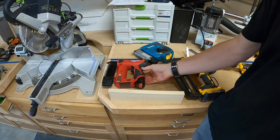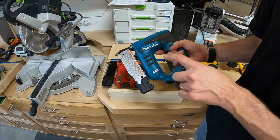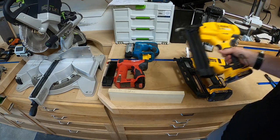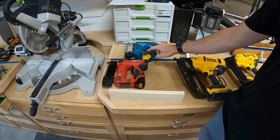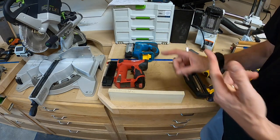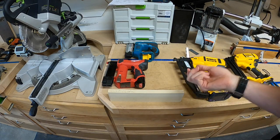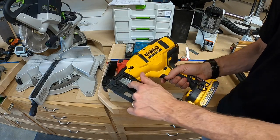The battery pinner is only 12 volt and weighs next to nothing. My 18 volt pinner was a complete disappointment — it was so unreliable I stopped using a pinner on job sites altogether and just brought the brad nailer for tiny moldings. But now this 12 volt pinner pretty much does all of it — crown molding on cabinets, flutes, pilasters, casing, and baseboard. That's crown molding on a cabinet with glue, not crown molding on a ceiling wall — for ceiling crown molding I would use this 16 gauge gun with a two and a half inch nail.